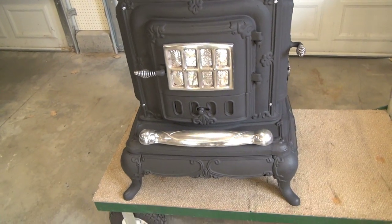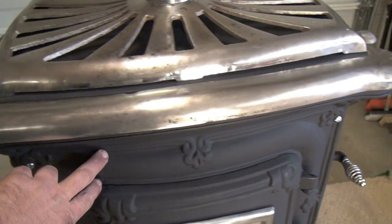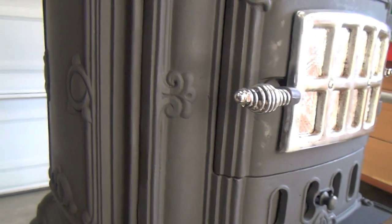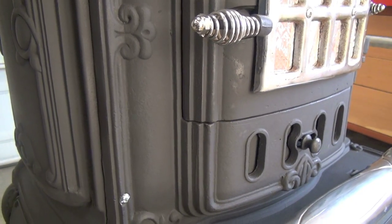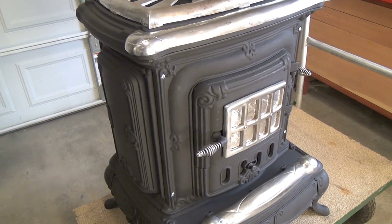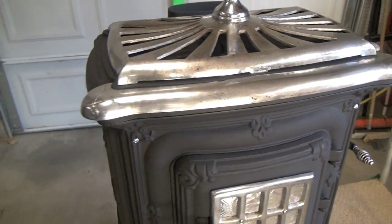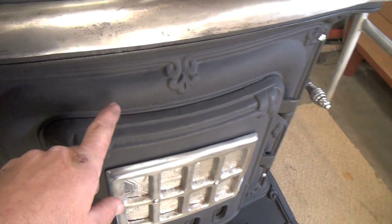I'm definitely going to make my money back and then some. Here's a couple of things I'm going to do next time — this is all a Rust-Oleum barbecue flat black. I didn't do the final sanding with steel wool; I wanted to keep it a powdery looking color. But next time I'm going to go either satin color to give it that sheen, or I'm just going to use the VHT brand 2000 degree on the outside because it's a little bit darker than the powder black. That's something I'm going to do next time — a different finish.